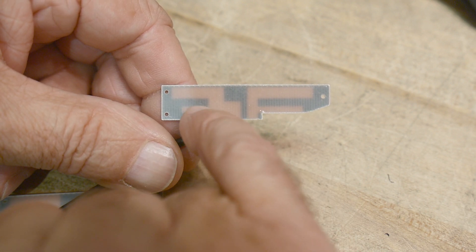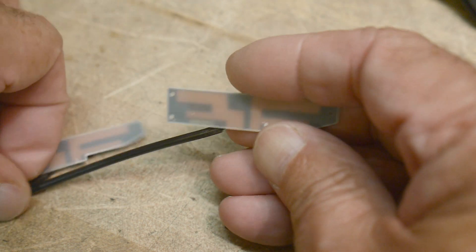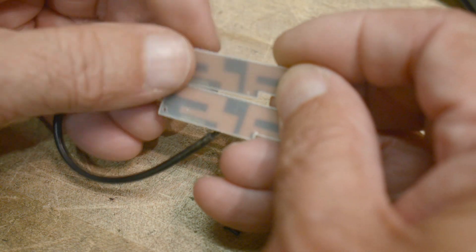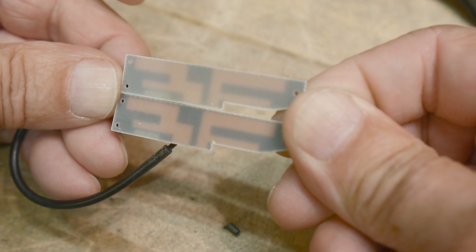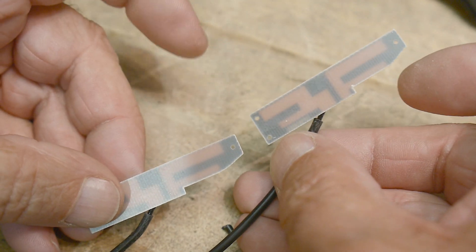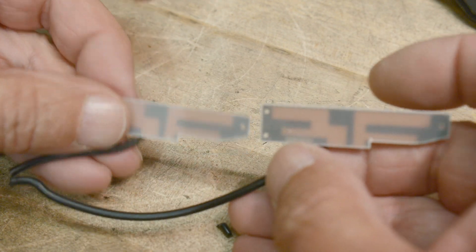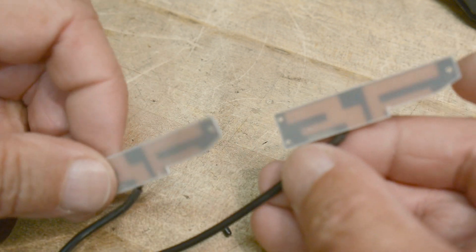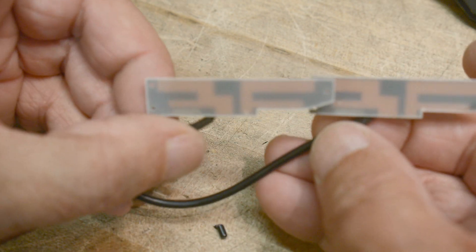This must be a little matching stub, or it broadens it — I don't know. And if we look at this one, are they identical? Let's put these up top and bottom. I would have been flabbergasted if they were different. Nope — they are exactly the same. So are they phased or are they just two antennas? It seems like it's a diversity receiver type of thing. I think as long as the two antennas are in different physical locations, you can get rid of multi-path and stuff like that.